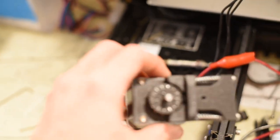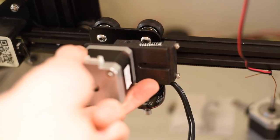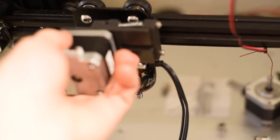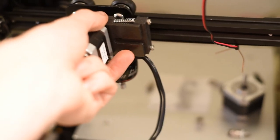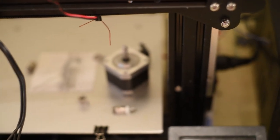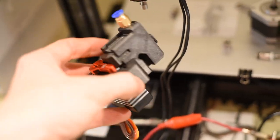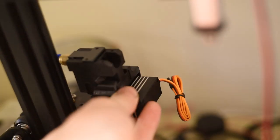And here we've got the pinch wheel extruder, and the pinch wheel extruder will basically go right here, more or less. It'll mount on top of the aluminum bracket with two holes to the left, and it'll line up the filament path with the top of the motor, and then there'll be a pneumatic fitting in here that goes to the exit pneumatic fitting on the bottom of this Smuff filament chopper that'll be mounted probably back here somewhere, where the regular extruder is.